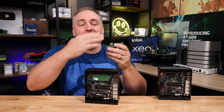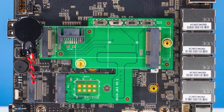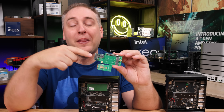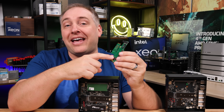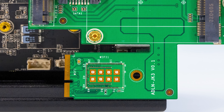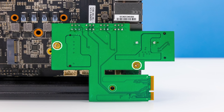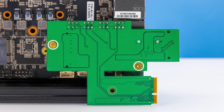The CWWK folks sent us something in this that I think is just a little bit different — this is the new board, and it is insane. You plug this in under the main M.2 slot. You still have your M.2 2280 port for another NVMe drive. But then you're going to see all these little switches, and depending on how you have it configured, you can have a SATA port, or an mSATA port or drive bay. There is also a pad placement on this PCB for some kind of chip — possibly a switch chip — that's on other models but not populated here. This is a brand new thing that CWWK sent, and it seems like this is the new direction for a higher-end little H board.